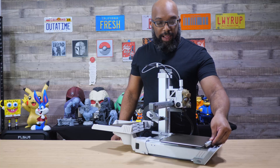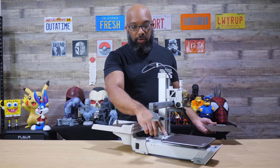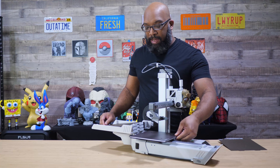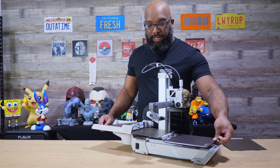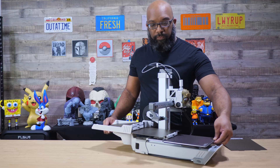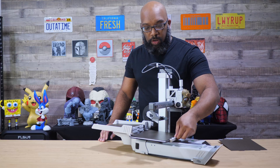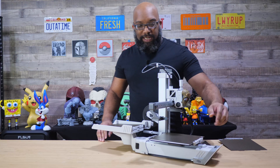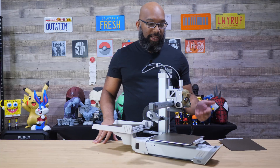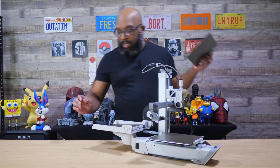When you don't have a plate on the bed you can see that this gripper piece actually moves up, and that makes it so that when you move the bed back it can grip onto another plate. It has to move back again to grab a little more and move it forward. Then once it does it one more time it's going to bring the plate and magnetize it down — it sits perfectly right there on the bed and then the printing process starts again.